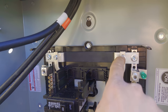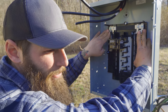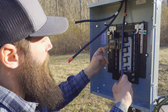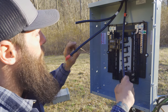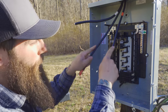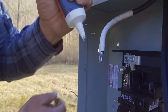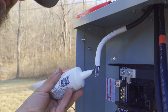Here there's a black insulator, but there's actually one bus bar going all the way through — so these two bars are bonded together. That's code here in the States. Next, we have our red wire with the stripe — we're going to tie that in along with the black wire. These are both our hot wires and we'll take them to the 100 amp breaker. From this leg to neutral you get 120 volts, or this leg to neutral — 120 volts. Take both legs together and you have 240 volts. We put Deox on our aluminum wires because they will oxidize and corrode over the years and you'd have a big fire hazard.